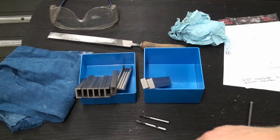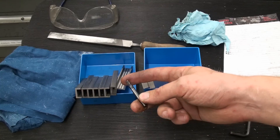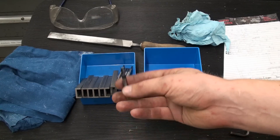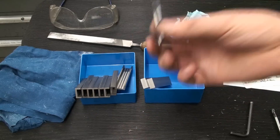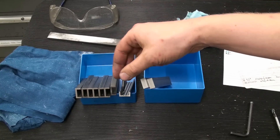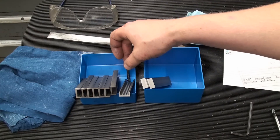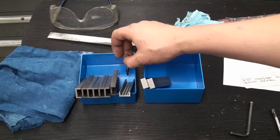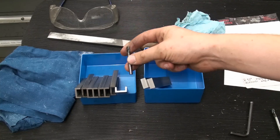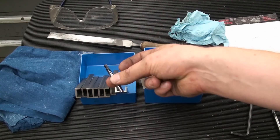Then I tried something else — a cheap coated three-flute carbide end mill with a 45 degree helix angle, used as if it were a roughing end mill. It worked spectacularly. I could take all the material out in three passes: came down the center 7 millimeters deep, stepped over, came back, stepped over, came back — done. Three passes to rough out the whole slot with an end mill that retails for about 15 dollars each. Reasonable cost, and I can do it dry because it's carbide.